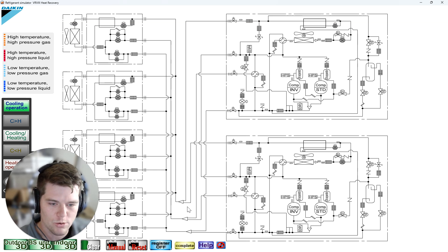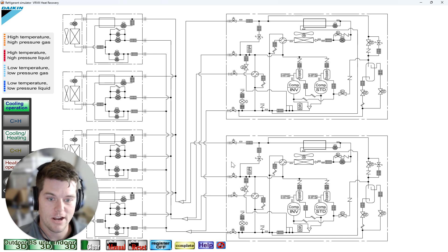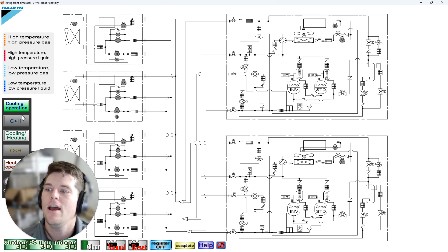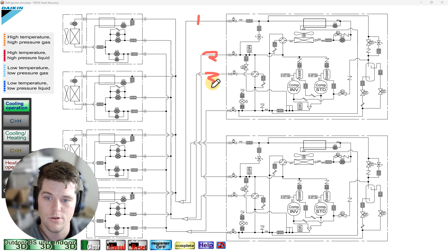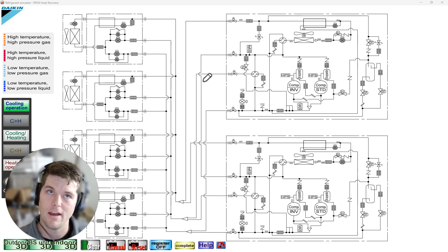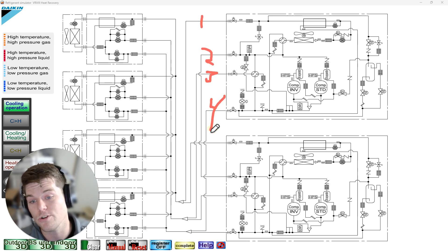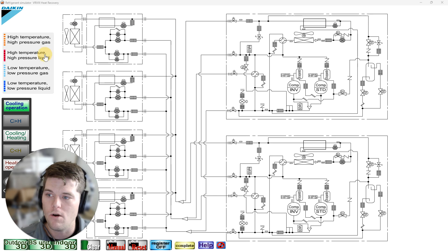When we talk about older model series of equipment such as VRV3 and VRV2, you might find heat recovery and heat pumps with four refrigerant lines. Daikin VRV/VRF — depending on who you're trying to upset — only has three pipes. Mitsubishi has two, Daikin has three. So what do you mean there is four-pipe VRF? The older series actually has four lines.